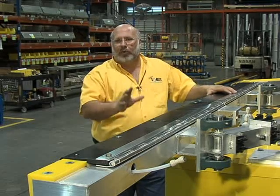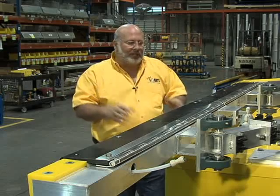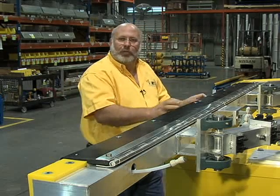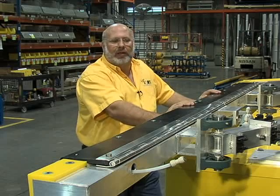It's not a spinning brush or a rolling piece of foam. It's a fixed foam pad saturated with tire shine that we pull it in and squeeze it against the tire. The tire conforms and flexes around the sponge, and the sponge wipes the dressing on the tire just like your employee would do in the detail shop. It's the most consistent tire shine machine in the market today.